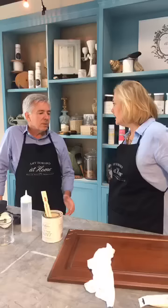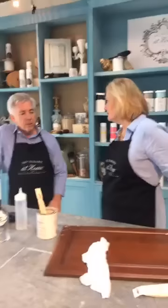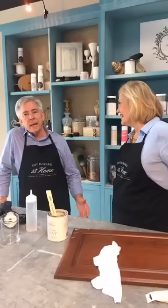Now, for years, Gene, what's one of the things that people have on their kitchen cabinets that they don't realize are there that they need to get off? There'll be Pledge, there'll be Old English, there'll be wax, there'll be grandma's, you know, 20-year nicotine habit. It'll be just all over the cabinets and they need to come off. So one of the easiest ways to do that is with our clean slate. A lot of times we've told people in the past to use Simple Green, which is a great grime and grunge remover, but it will not remove wax. So if you've got wax on your kitchen cabinets or a piece of furniture, you've got to make sure you get that off.